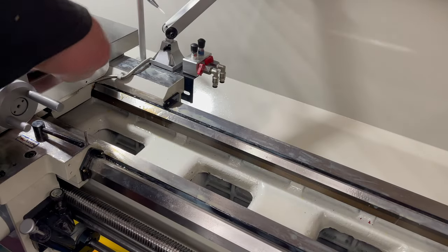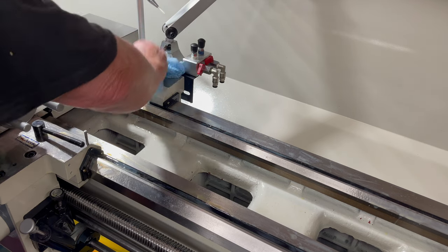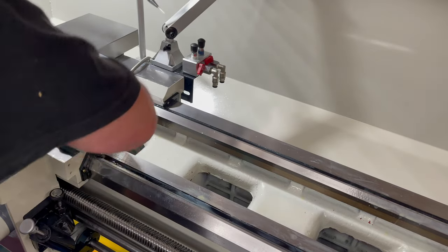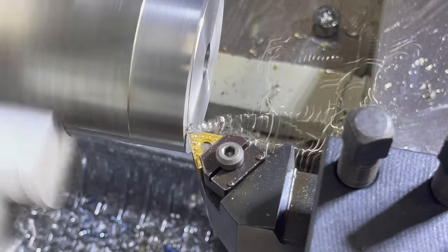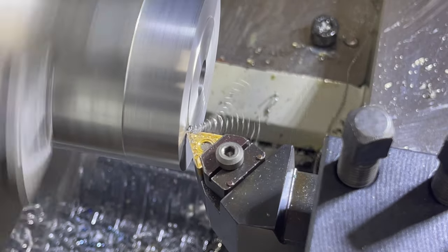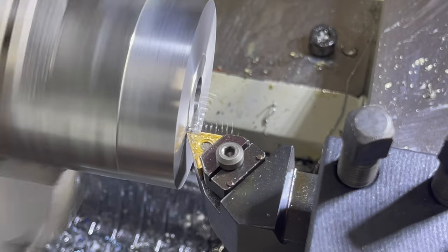Now back to work. I'll start up the Toolmaster and machine some support washers for the feet. I plan on retaining the adjustable foot, so I should only need 7 washers. I'll make these from a 65mm bar of 4140. This is a simple job. Just face it, bore it, and part it off. I've had my Toolmaster now for around 5 months, and by comparison I'm seeing some inaccuracies in the Colchester, so it's time to address them.